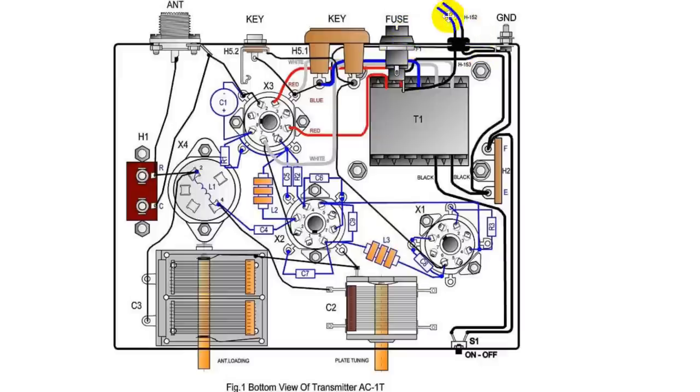There's a real fuse, and the power cord is polarized so they can attach the neutral side to ground. You've got three tube sockets, one of which is actually a crystal holder. These are your two tubes, which you'll wire up. Note there is high voltage wiring in here. There is a very detailed step-by-step method for assembly. The coil form determines the band: 80 and 40 are pretty good, 20 is a stretch.